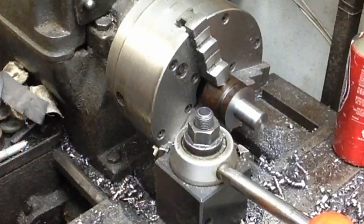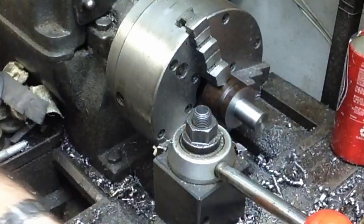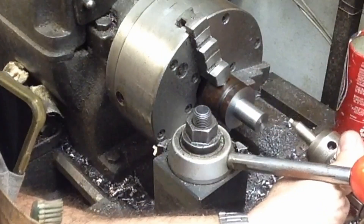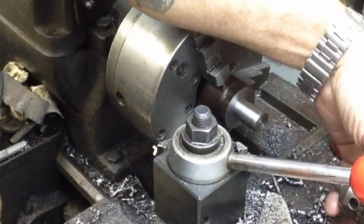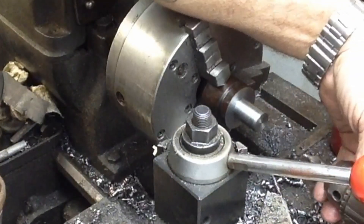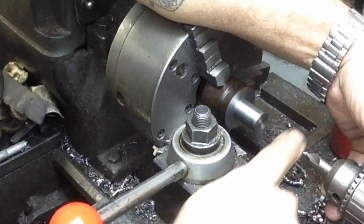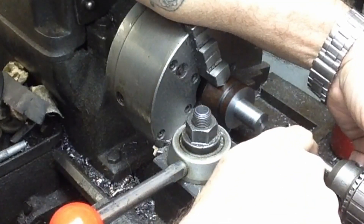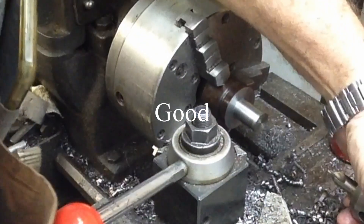Here we're getting a little bit better view. We're going to go ahead and drill and chamfer these, and we're going to center drill this one. Now this lathe is pretty well worn. It makes a big difference on how centered and how round my hole is, how I orient these drill bits. So if I orient it like this with the gullet of the center drill — and the following drills — so that gullet is top and bottom, I'll get a truer hole.